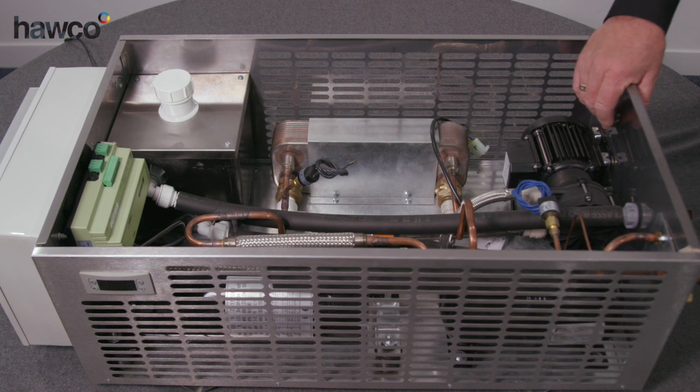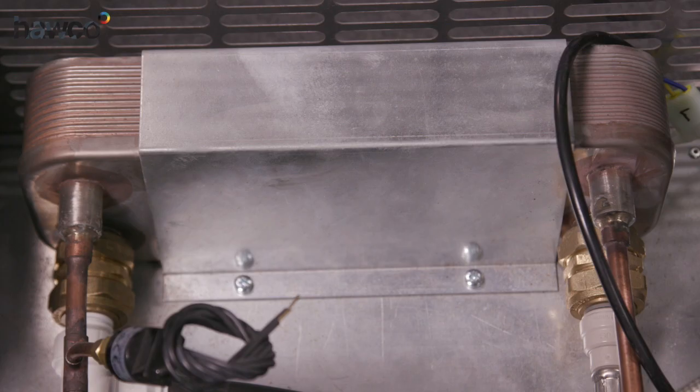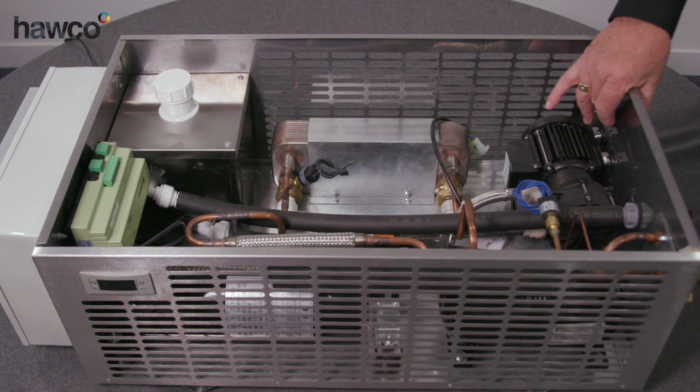The concept of water loop is that instead of having an air blown condenser blowing warm air into your supermarket, you have a plate heat exchanger which will remove the heat from the refrigeration system and then pass it through the store outside to a chiller where the heat is dissipated to ambient.